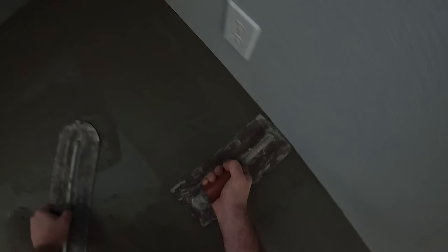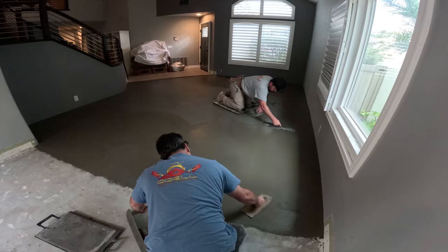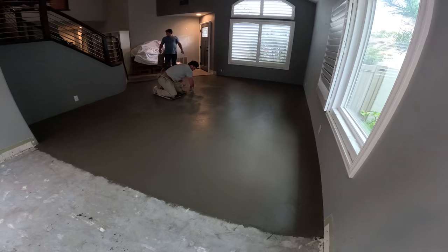They left the tile on the existing concrete at the higher elevation, so we just kind of eyeballed about three quarters of an inch below top of tile. That'll give them enough space for thinset and tile to flush out. The main thing to remember is it's better to be low with your concrete base than high, because you don't want to have to take hard concrete down — it's easier to bring it up with thinset or other fillers.